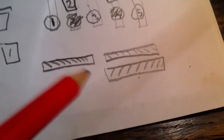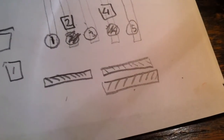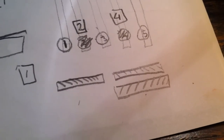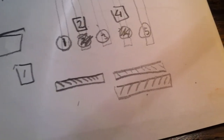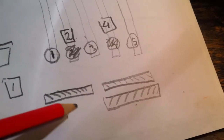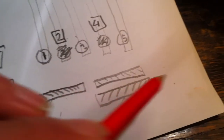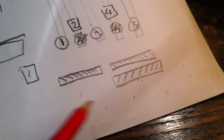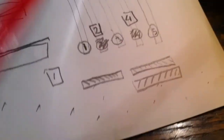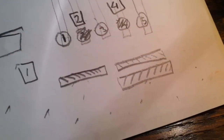The reason is that once you put the varnish on it, depending on which direction the grain is going, it will reflect the light back to your eyes in a different way. So you can get a very beautiful effect, because the way the light reflects back to your eyes is different for each rib, it's opposite. Especially with lighter wood, with cherry for example, it's a very beautiful effect.